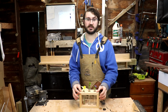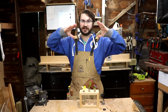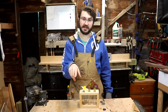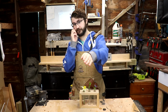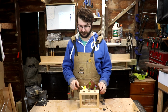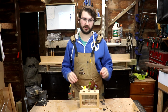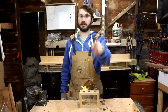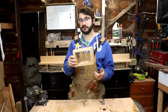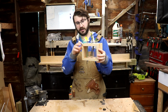Regarding the miters, the first time I did them, they were not all 45 degrees. I realized that when I put it together and it was like a trapezoid almost. That's because the sled I used was used with a different blade, and the kerf of the other blade was thicker, so the 45 was not really 45, so I had to adjust the edge a bit. And I think the second go around, where I fixed the longer piece, where I cut it smaller, that 45 ended up being exactly 45, because I used the electronic angle gauge to determine 45, and that was spot on. I think that's what I should have done for all of them. Luckily, it ended up not really being a big deal. It is square for the most part, and it looks great.